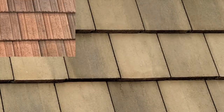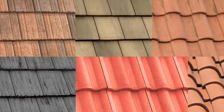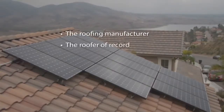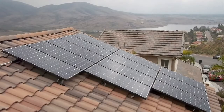Tile roofs vary considerably, so it is important to know some basic information about the roof prior to the installation. If possible, talk to the building owner and/or perform a site visit to gather information on the roofing manufacturer, the roofer of record, roof warranties, age and condition of the roof, and construction and waterproofing under the tiles. These details will help ensure that you use the best methods for attachments and waterproofing.